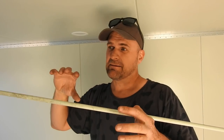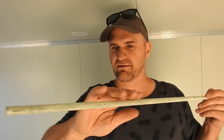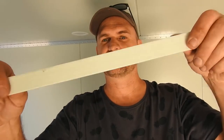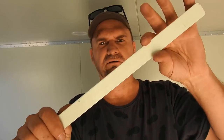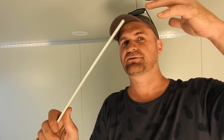The second moment of area means that if you double the thickness of something, you multiply its rigidity by eight. So I ordered some fiberglass flat bar — it's five millimeters thick, about 25 to 30 millimeters wide, and pretty stiff. I'm going to use two of these as my leaf spring to open the door. I'll cut a rebate either side to lock it in place, with a bend like this to push the door out. I've made up these little roller brackets with a small radius to allow it to bend around smoothly without too tight a bend radius.